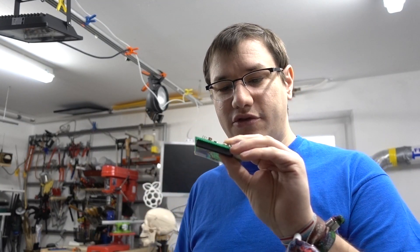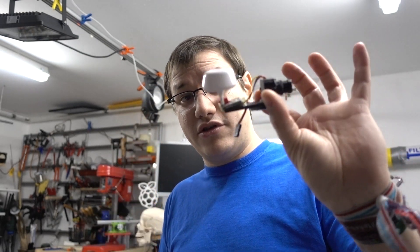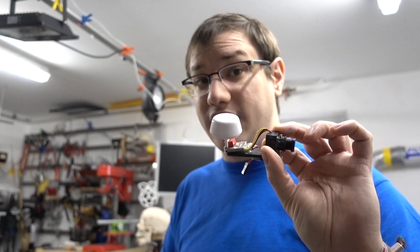It's very important — don't forget to add Escape and Y, because those are the buttons needed to quit the game. Now it's time for the power supply. I tried to use these nifty little 5V power supplies which worked in a lot of projects, but not in this one — they can't supply enough current. So I opted for an option that worked before: a very beefy BEC from an RC plane which can provide 5A, and a compact 2-cell LiPo. It's not only about powering the Pi — we also have to power two Arduinos and the video transmitter, which consumes quite a bit of power.